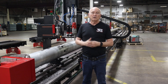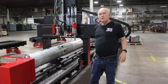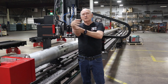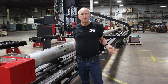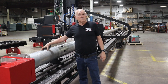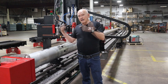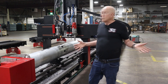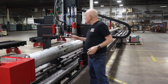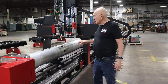We want to position this machine as the premier fabrication machine for people reading NC1 files on structural steel up to 12 inches — railing, that kind of work. That's why we developed the long machine: to handle 40-foot sticks of structural steel natively without having to spin it. On our current machines, if you try to spin C-channel there's no torsional rigidity and the part just bananas back and forth. The best way is to load it flat with a forklift and not spin it — that's why we needed the BLE.